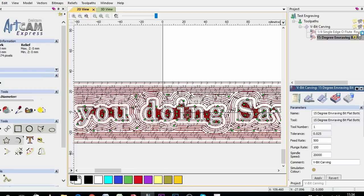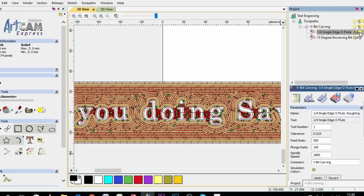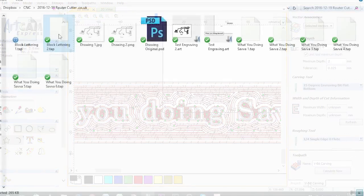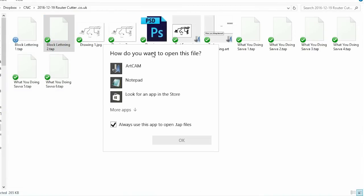I'm just highlighting the area which would be rough cleared with a quarter inch bit and the detailed work of the flat point engraver. The first thing I have to do however is work out how to control the feed rate.